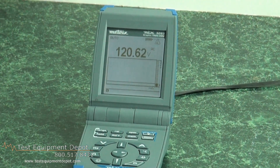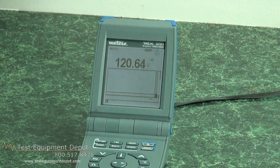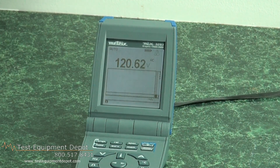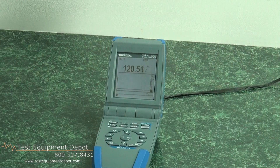It has memory, which makes it unprecedented. It can store up to 6,500 points. I'm taking a local voltage reading, and I can store 6,500 readings at a rate of once a second. That allows me to go out to 6,500 seconds for a recording session — so this device can record.